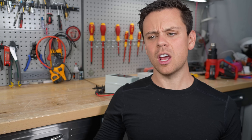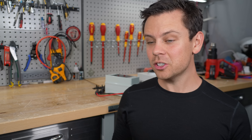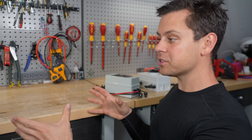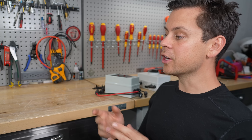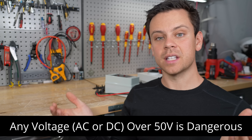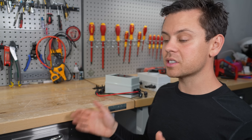A lot of older guys will say it's not the voltage that kills you, it's the current. But everything in the solar power system can deliver enough current to kill an elephant. What actually matters is if the voltage is high enough to overcome the resistance of your skin and allow current to flow. Less than one amp can kill you, but a battery delivering a thousand amps at 12 volts — you can touch both terminals all day and nothing will happen. Per NEC and OSHA, any voltage over 50 volts is dangerous, and pretty much every solar system on the planet now has a string voltage higher than 50 volts.